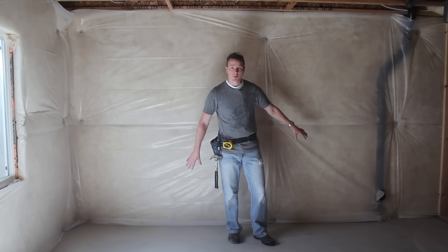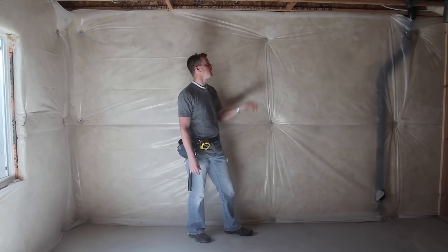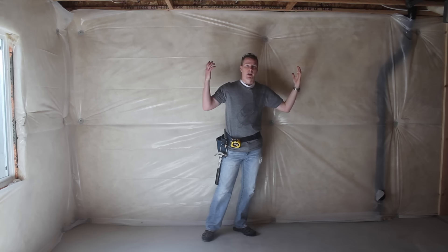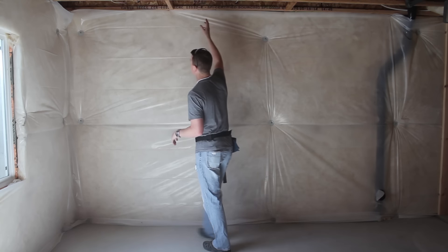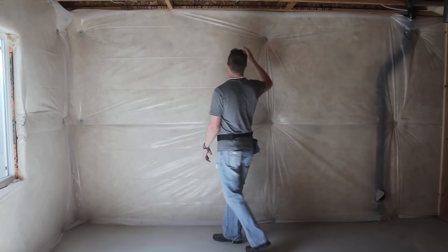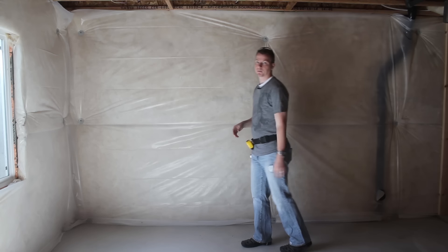I've decided we're going to start with this wall behind me, and the first thing I need to do is prepare a place to fasten the top plate of the wall we're about to build. The ceiling joists are running side to side, and in order to have something for that top plate to fasten to, I'm going to need to put some boards in here — some studs — cut to the distance from here to here, and put those every two feet on center. I'm going to get a bunch of these cut and then put them every two feet on center using my nail gun for framing.